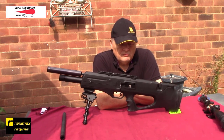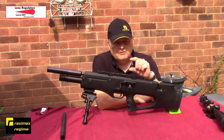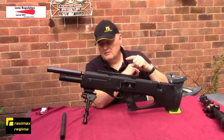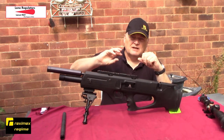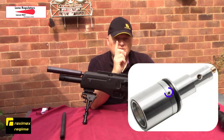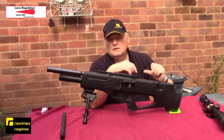That's if you're doing the full tune. What I would suggest unless you've done this before: don't bother drilling out the transfer port, just leave it as is. Just put your regulator in - there's a little packet of silicon grease included in the kit, put that on your O-rings and slide it in head first into the cylinder, push it all the way just before the end of the threads. Then screw your valve back on and that'll push it in. When you put the regulator in, there's an air breathing hole on top - make sure that's pointing upwards, otherwise oil in the regulator can leak out. It comes set to 90 bar.